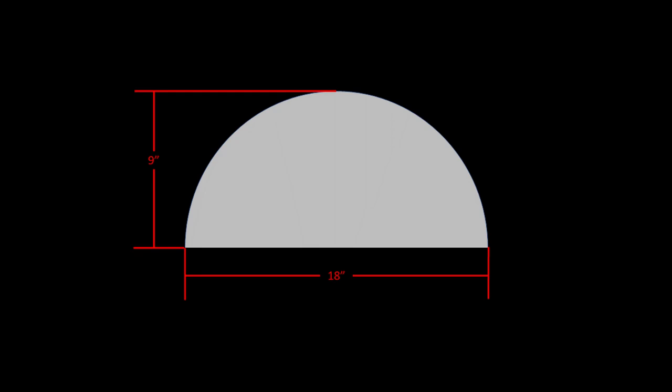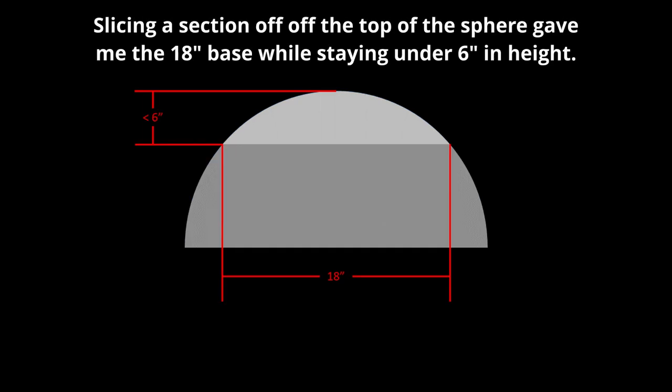Once I figured out that 18-inch diameter for the base wheels, I knew I had to figure out how I could make this and keep the dimensions under 6 inches. With the 18-inch base diameter, if I just took the radius and cut a sphere in half, it would give me nine inches — three extra inches would have made this much too wide to fit through standard or accessible doors. Luckily, I was working with a pediatric or juvenile wheelchair, so I had a little more room to play with.